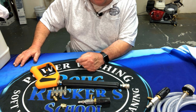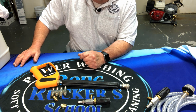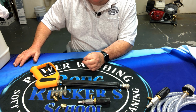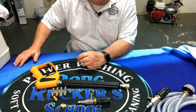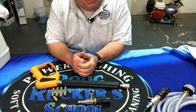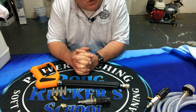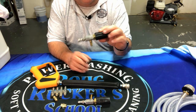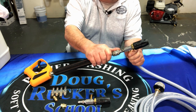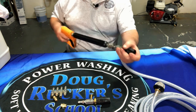Now I'm going to talk about the X-jet modification. I did a video on this a year or two ago and it blew up, but one of the problems is I forgot to mention putting the orifice and the little spring back in. A lot of people would hook them up and water would start flowing back into the bucket. So as part of this all-things-X-jet video, I want to correct that. The nozzle normally hooks like this onto your hose barb and goes on the end of your lance.